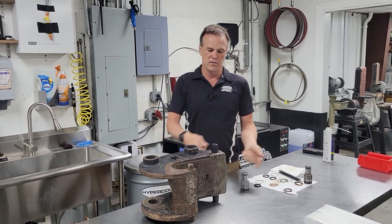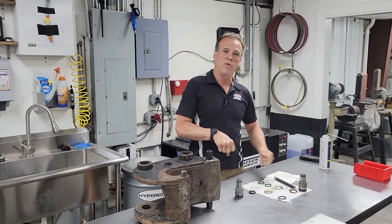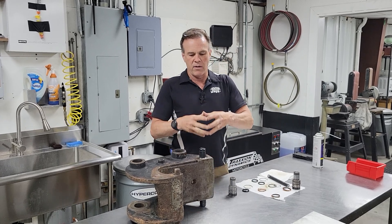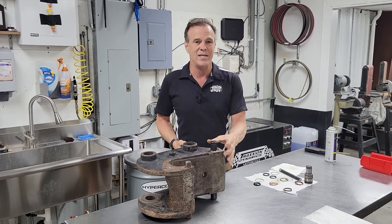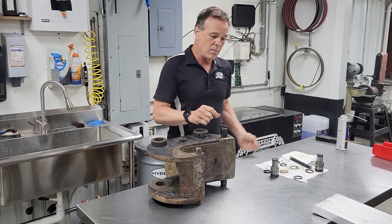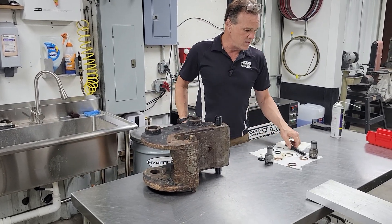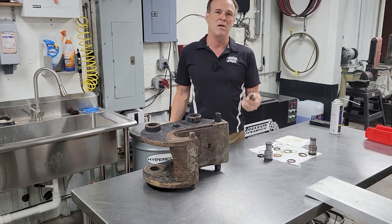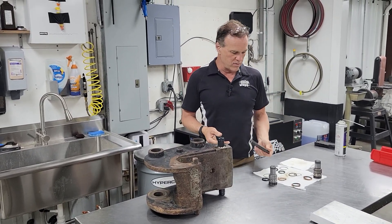From there, put it back, lay it flat on the bench, take your long extension, and tap that first assembly all the way out until the bearing seats against the circlip — so you've got it as extended as it can possibly be. Make sure this piston is all the way out, because when you put the spring in, you want the minimum amount of spring pressure possible so that you can work on the other side.